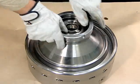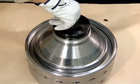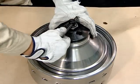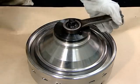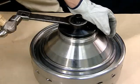Screw the disc clamp plate into the distributor and tighten the nut with a wrench to compress the disc. Compressing the disc is an important procedure. Its purpose is to dampen the springing effect in the disc mounted on the bowl to protect the thread of the bowl nut and make it easier to tighten the bowl nut.